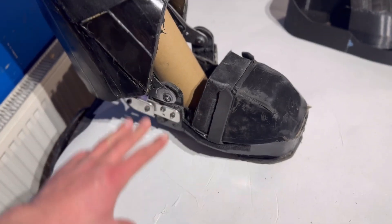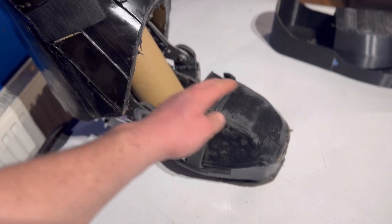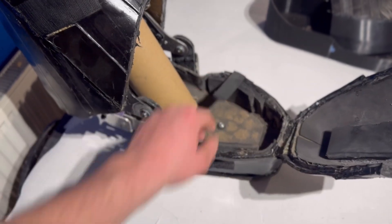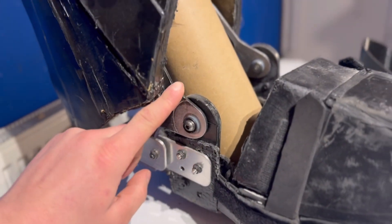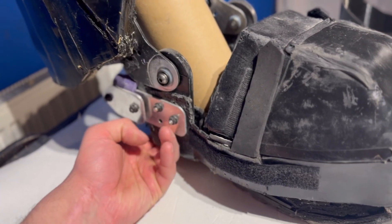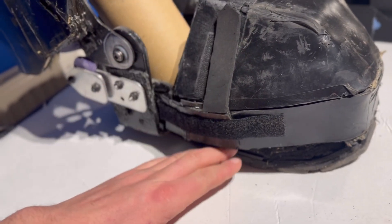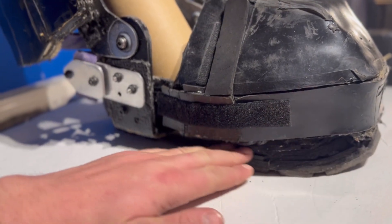The premise of the boot is that as the operator you would wear your own walking boot or combat boot, then step into the exoskeleton with it on — stepping into the legs and boot from behind with the front toe cap lifted up on a hinge. The inside is padded to go tight on the boot, and when you close and velcro it up, the boot is tight on the feet. This attaches to the main exoskeleton at the ankle joint, allowing slight left-right rotation, while the sole with tread is mounted onto rubbers packed out with foam for lateral movement.